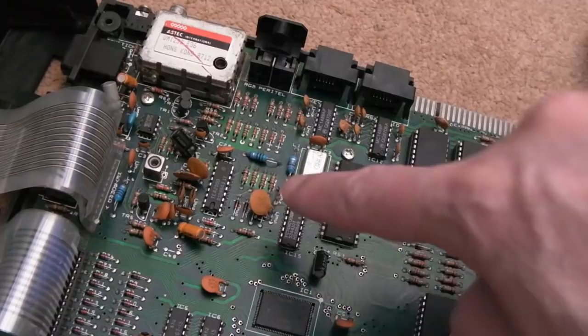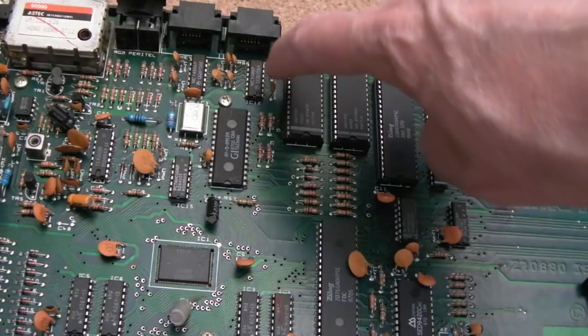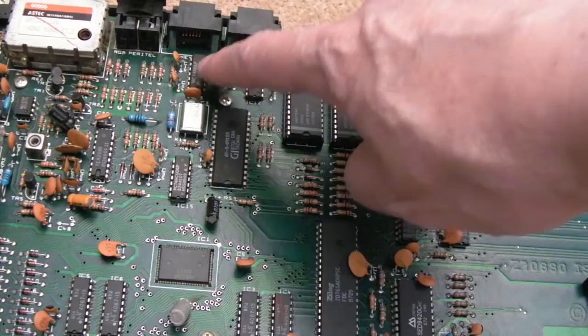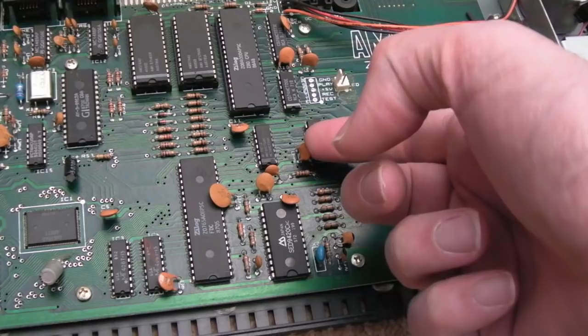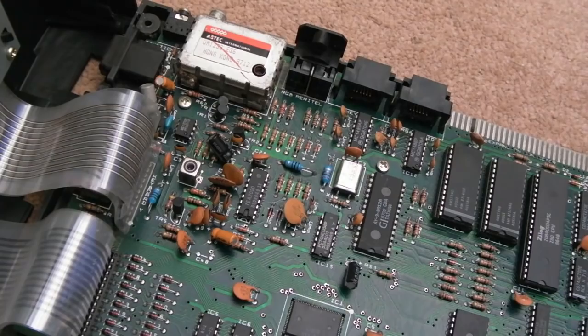And we've got the video encoder here, TEA2000. We've got a 74HC chip here. There's your AY sound chip. And we've got a 1488 and a 1489, your serial transmitter and receiver pair, connected to these, I think. And then just some more 74 series stuff over here. They're probably CMOS compatible. That looks like an MC1376P. I'm not sure what that is.